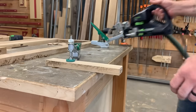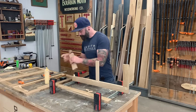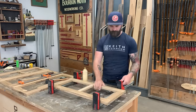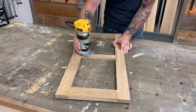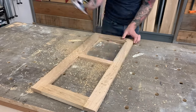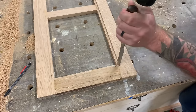With the grooves routed where the internal brace is going to be, I pull out the Domino joiner or doweling jig — whichever you prefer — and hook all the doors together: two pieces on each end, support in the middle. Clamp them all up and let them dry. Here's a good example of why you do that small routed groove first — you can see the bit runs right into the middle brace. But with the doors all glued together you can now finish off the rest of the groove with the router.